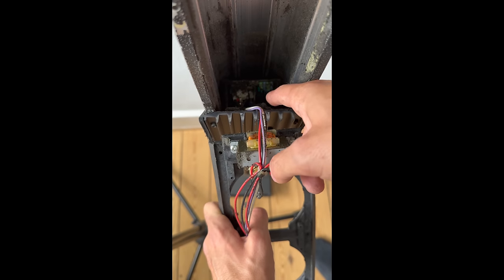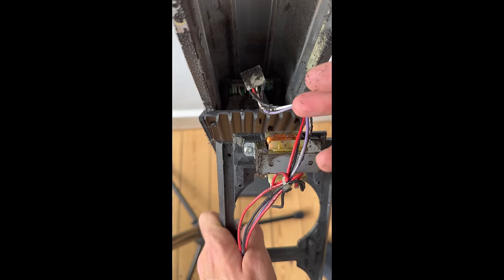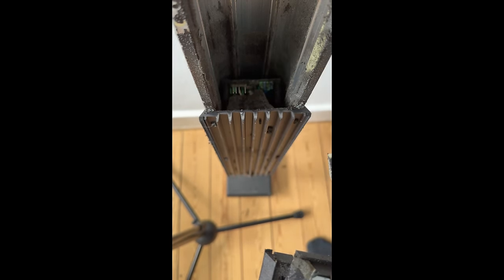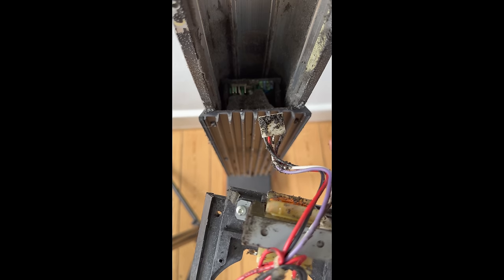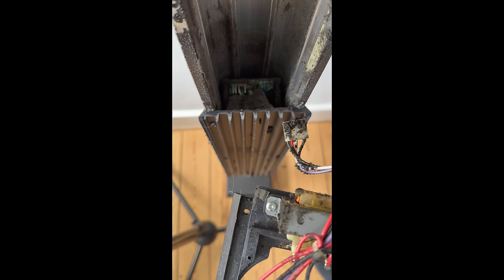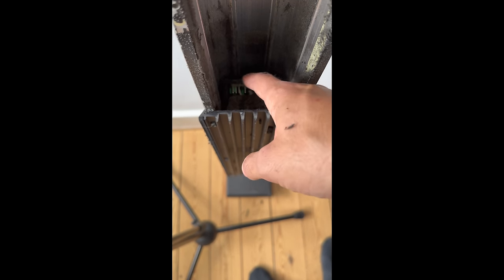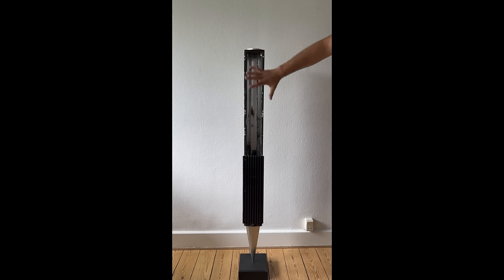There is also very rotten foam here. I'm going to show you how to do it one step at a time. We also need to clean the cables. Take a vacuum cleaner and clean the bad foam material out. So we have completed the process to remove all the woofers and the cabinet.